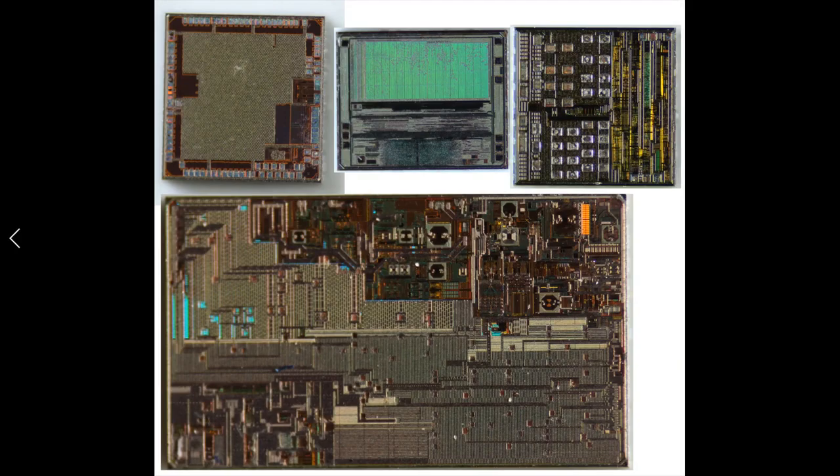Here's all the pictures together — all the dies, all scaled to real life. The question a lot of people would have is: why didn't Raspberry Pi just put Wi-Fi directly on their new Pico? You can see that the Wi-Fi die is just massive compared to the Pico itself. In semiconductor engineering, the size of the die determines basically the cost of the product. The other thing that always surprises people is that the actual NOR flash and the power supply circuitry are just as big, if not bigger, than the Raspberry Pi itself. So there we go — that's all the semiconductors on the Raspberry Pi Pico W.